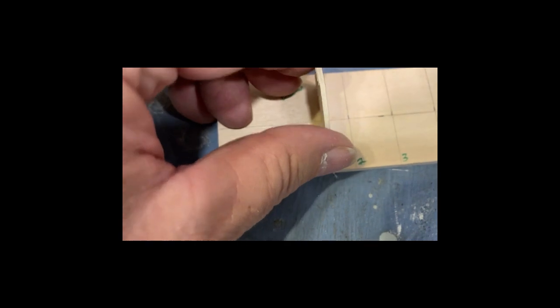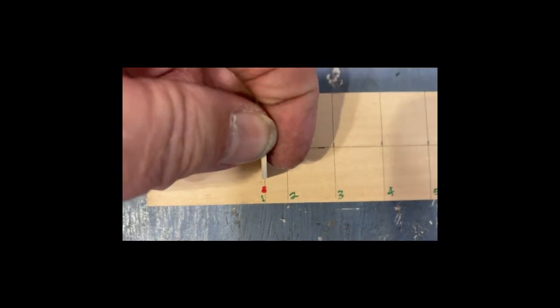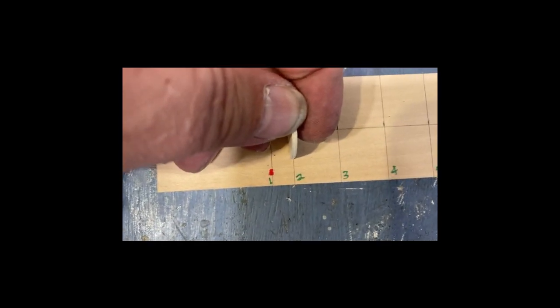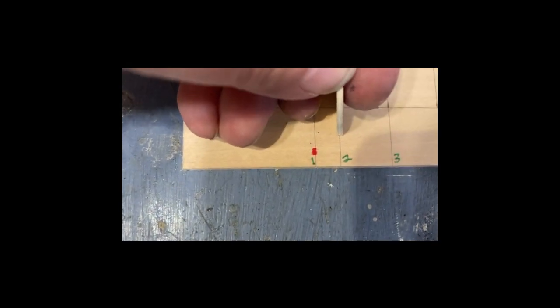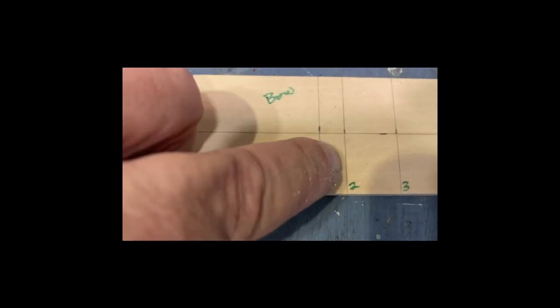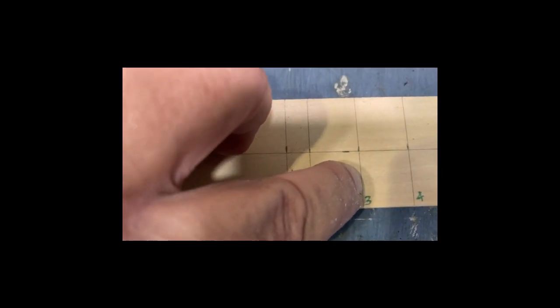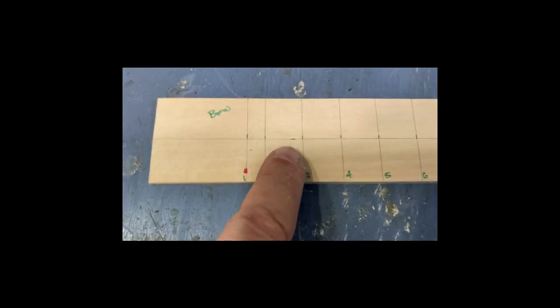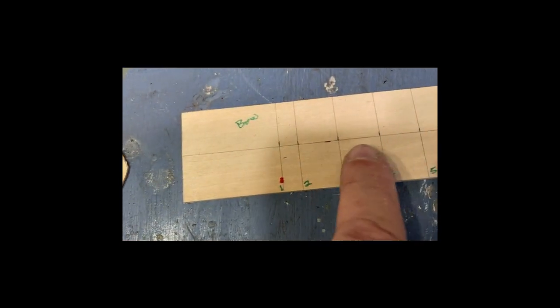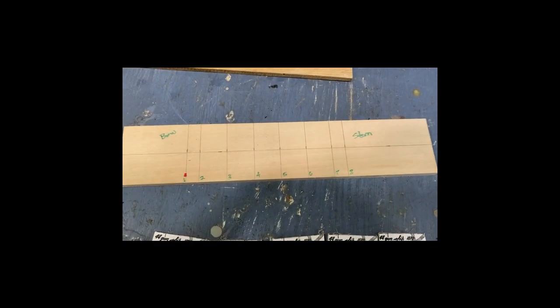because you're going to put this spacer on here, basically like this, you see, right dead center, that line, right, and the next one's going to be here, like this. So that space between the two is going to be a total of a 1/16 inch, in this case, smaller than this measurement. And again, between here and here, it'll be a 1/16 of an inch smaller than this measurement. And so I'll measure off on this stock, the piece here, a piece here, a piece here, here, here, here, and here. And when I have those cut and I'm ready to put them on, I'll show you.